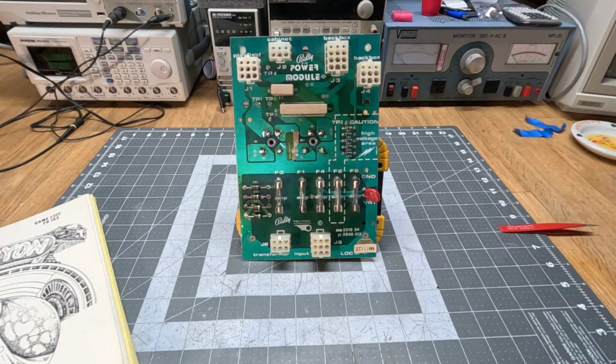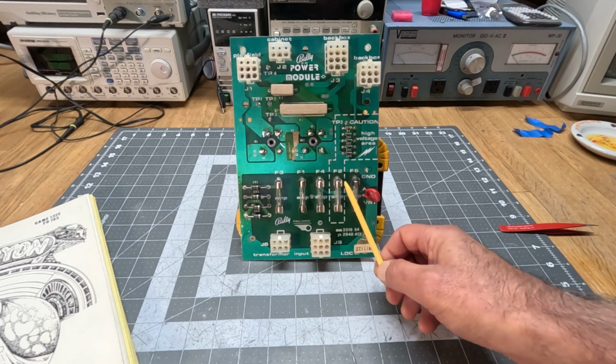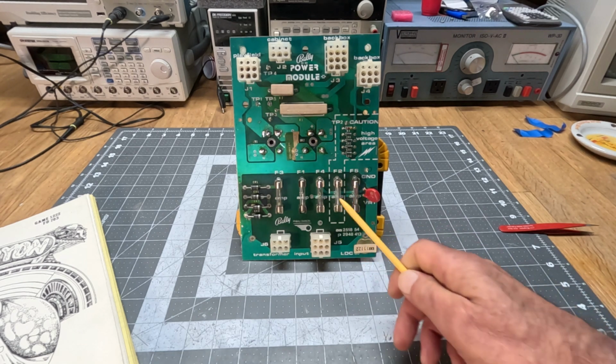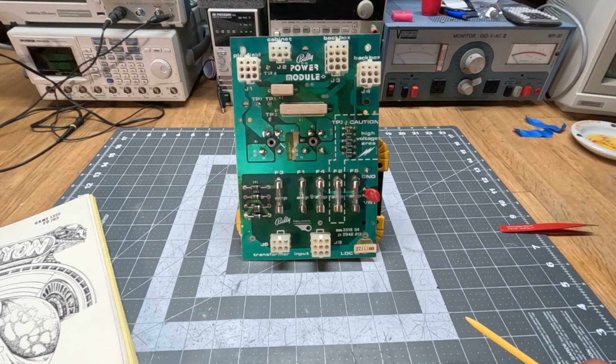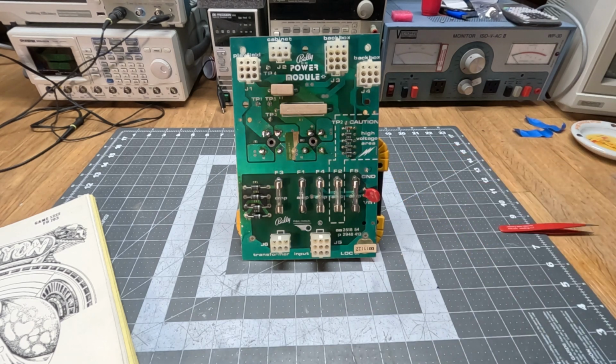But using a Dremel tool with a small metal brush attachment to clean out the inner surfaces of these fixed the boards that were suffering from problems. And I think what the other boards also needed was at least one of the rectifiers replaced. And all four of them came back. I didn't film it because it really wasn't a very complicated repair.